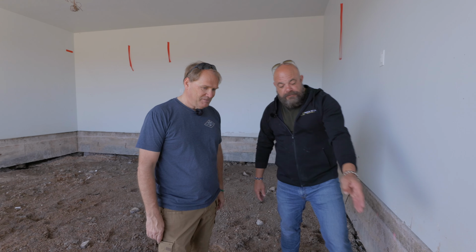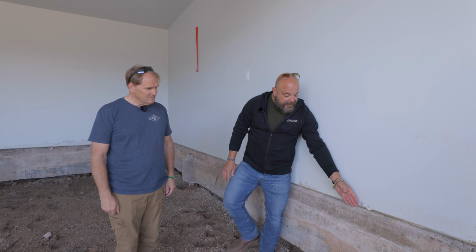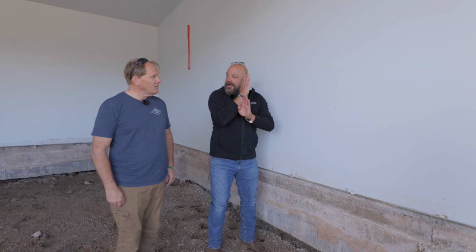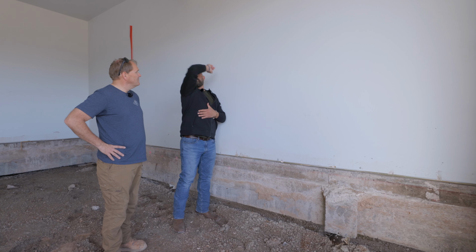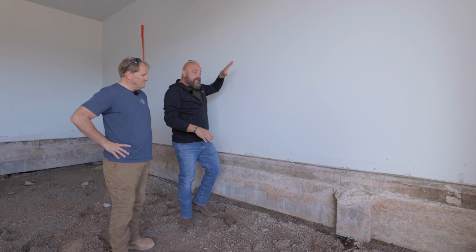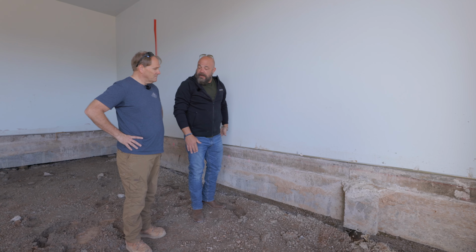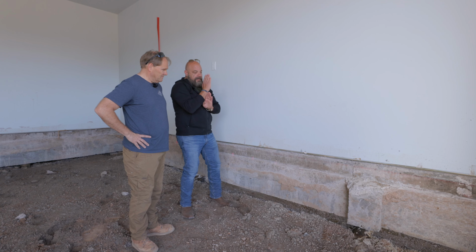And we discovered that these piers were offset. So they weren't directly underneath these grade beams, which actually causes a torque and a torsion on the building itself. So the main portion of this building is held up from this area here. There's steel beams that go across there. So if you can imagine, this building and that building are being held on this grade beam right here. So now that this is off here, technically most people can't see it, but it causes a torque this way.